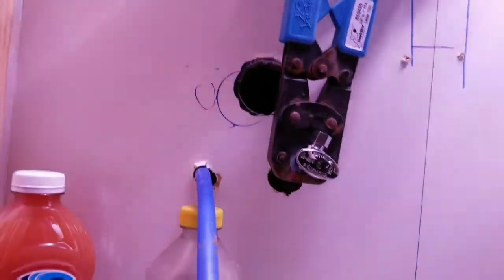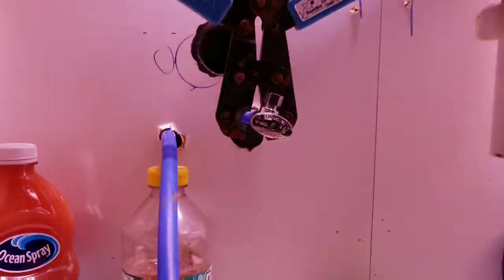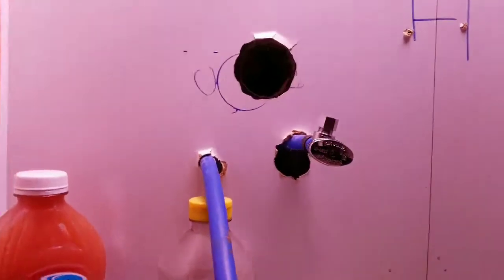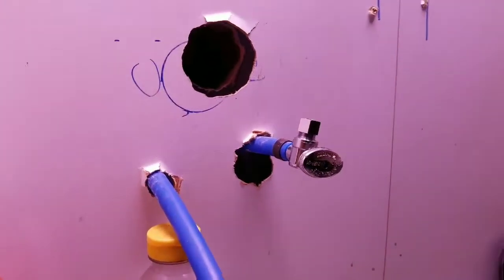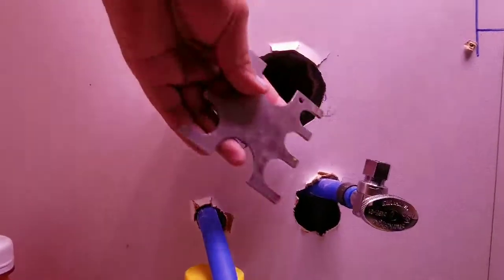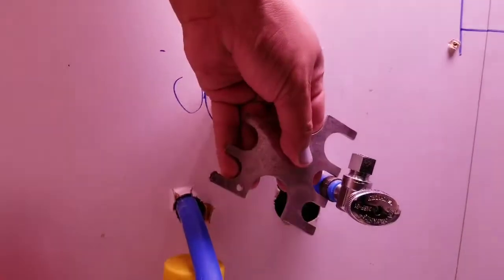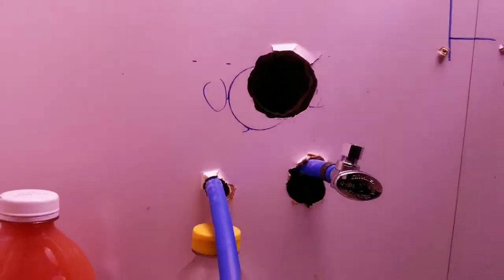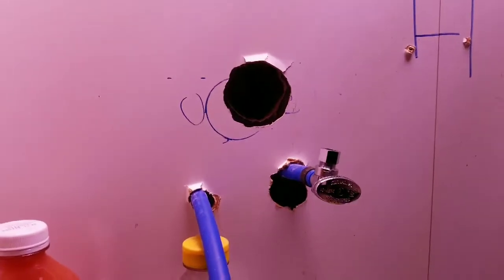There you go. Whew, that stuff is tough. You got the go, no-go gauge? Yep. Alright. Sweet, that was pretty painless. Oh good, it doesn't go in the no-go. That's good. So we're safe. That one has passed inspection and hopefully shouldn't spray water everywhere.